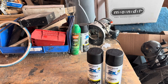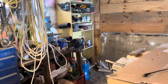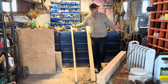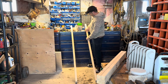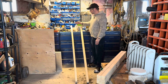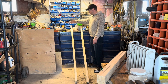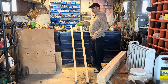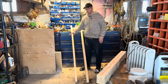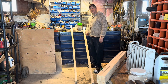So let's get started building the frame or at least getting the parts cut to size. The first thing we're going to do is measure the glass. We have our parts cut now — you're going to have to figure out your own measurements for the piece of glass that you're using. My glass is going to sit flush on the top to the edge, and then I'll put a couple of little pieces in there to make sure it can't move around. We're going to build the box frame first, then add the insulation to the back, cut the plywood, and make the backing. So let's get this first part started.